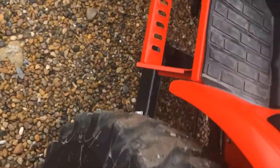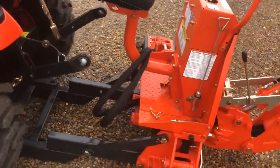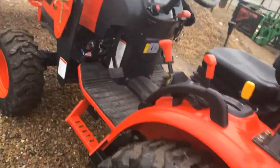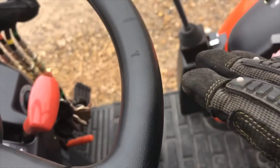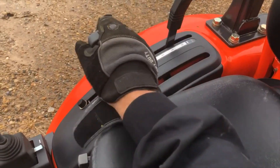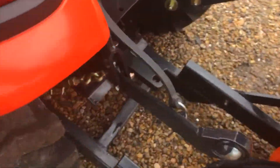Backhoe is disconnected up front also, as you can see. So that's how you take the backhoe off. To put the backhoe back on, once you back the tractor up into position you'll just line it up in the middle. Come over — you'll have the tractor on when you're moving it, but turn it off. Wiggle your joystick again to relieve the pressure so you can reconnect your hoses.